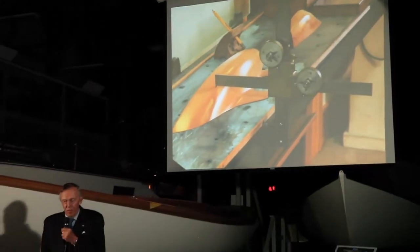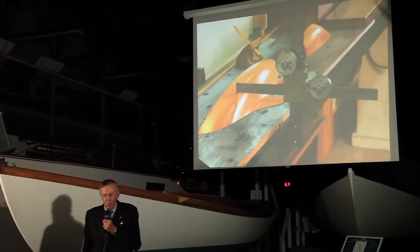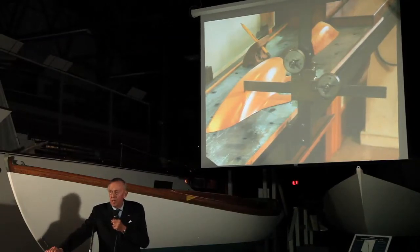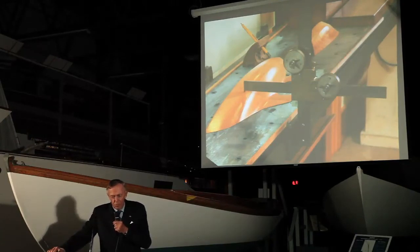Now the next part, which partly answers the gentleman's question, is perhaps the most interesting. Captain Nat wanted to design his boats by making models, which was not the vogue for designers in the late 1800s, though it had been the method in earlier years. People building ships would make models and had an awful time reading dimensions from them — sometimes they'd even carve up a model like a loaf of bread, lay the pieces down on paper, and trace around them to get the shape. Others made models with layers separated at different waterlines, held by a peg, then took the model apart afterward. But Captain Nat solved this problem in his typical fashion and designed a special apparatus called the offset machine.